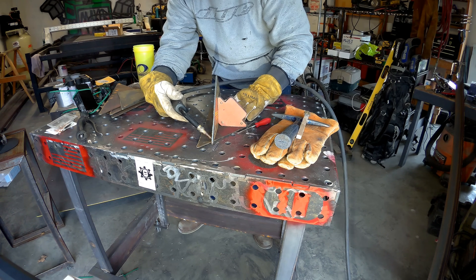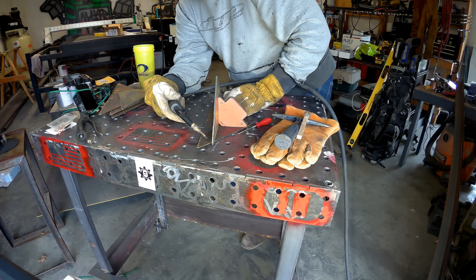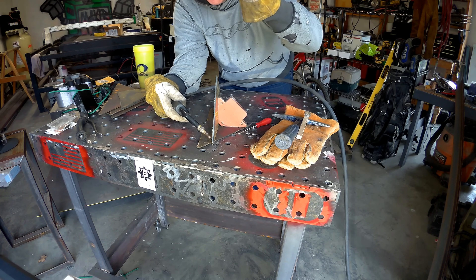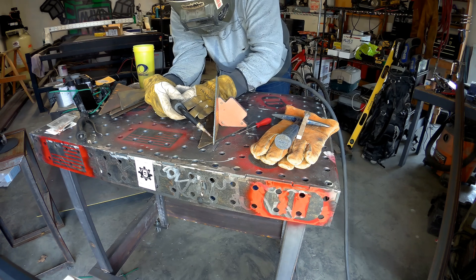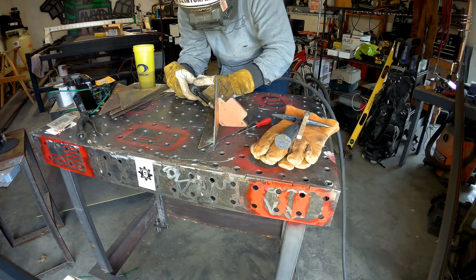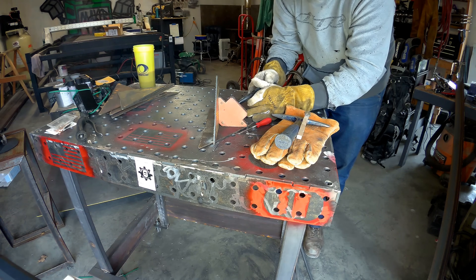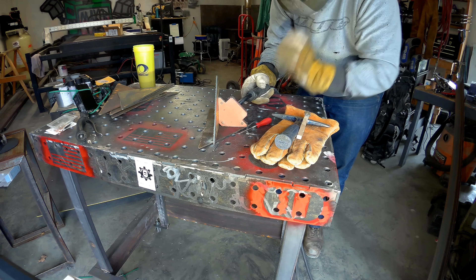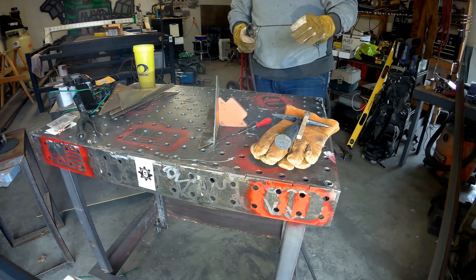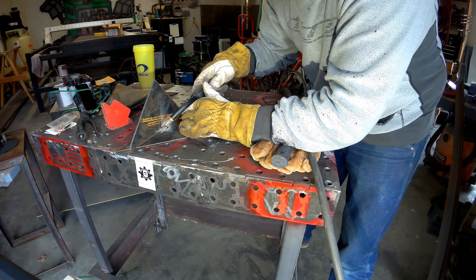All you're going to do is touch the electrode to the piece, make sure your distance is about three-eighths of an inch, and I like to rest my hand, elbow, or even my hip on the work surface — you want to stay as still as possible. I'll tack this together in three spots: one tack, two, and one more on the other side for good measure — three. Right out of the box with the factory-recommended settings, let's see how we're doing.